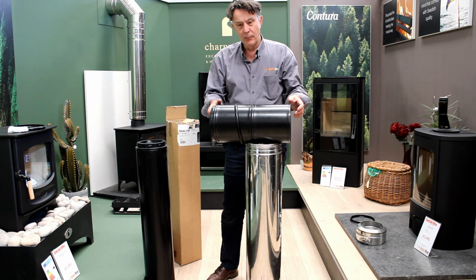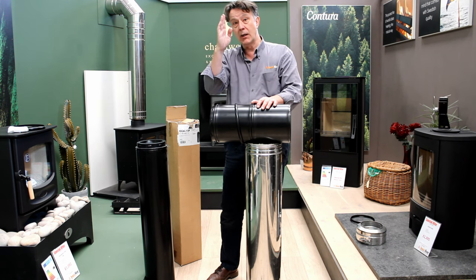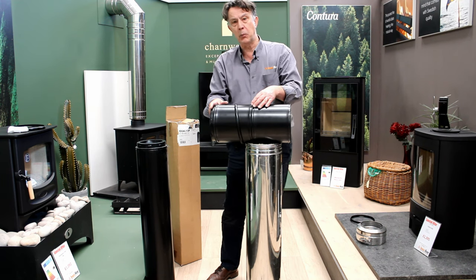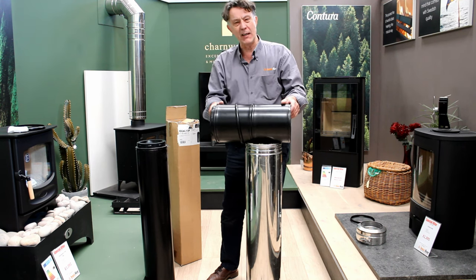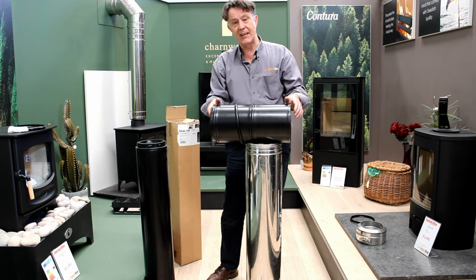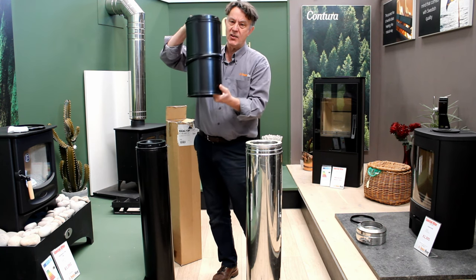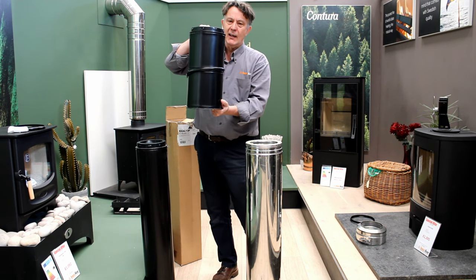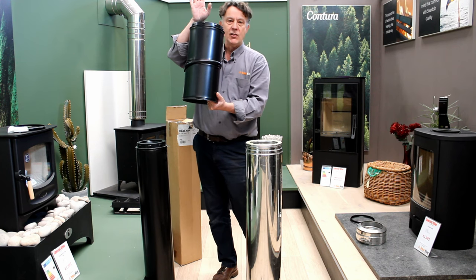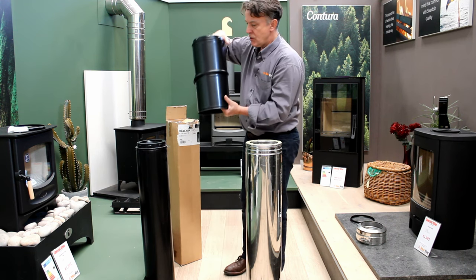You might think, well, why is that a problem? With flue, of course, you want rigidity, and you also sometimes want the flue to project beyond a point where you can get a bracket. This type of flue, if it had a strong wind playing on it, is not going to be as stable or behave as well in a strong wind, or if you've got a metre or two metres extending beyond the bracket. Because you have to twist it to lock it, on straight lengths that's not really a problem, but when you get to bends and you're trying to line up bends under soffits and around verges, it can mean it's difficult for the installers to line the bends up. So a lot of installers are not that keen on it.